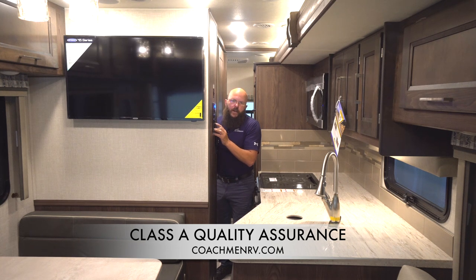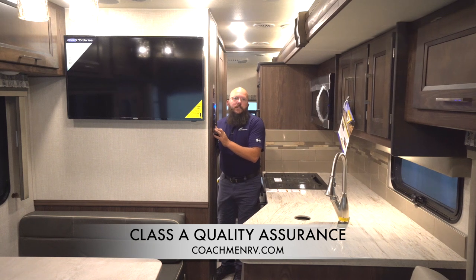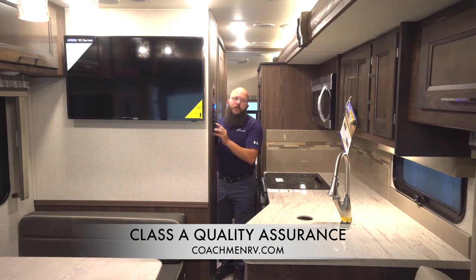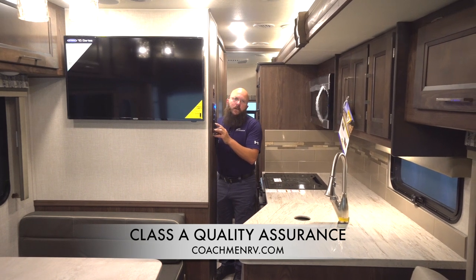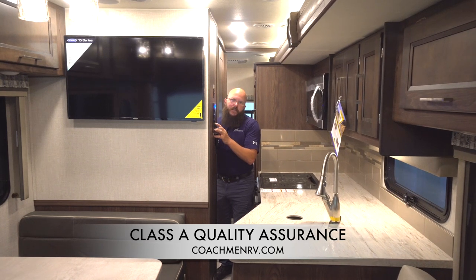When you initially come into the room, regardless of the position in or out, you may find yourself having to run the room whatever the closest direction is, and then you'll want to default back to this once you get the room squared up. To program it properly, you're going to want to bring the room all the way to the closed position. I'm going to run it out here just a little bit so you can see the full motion. Returning the room to the end position, you're going to want to stay on the button until the room comes to a complete stop.